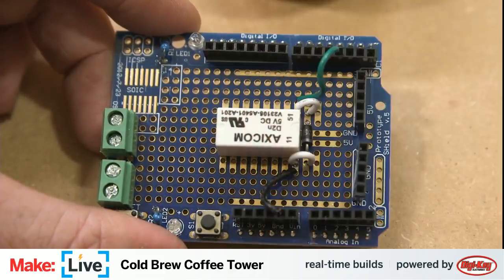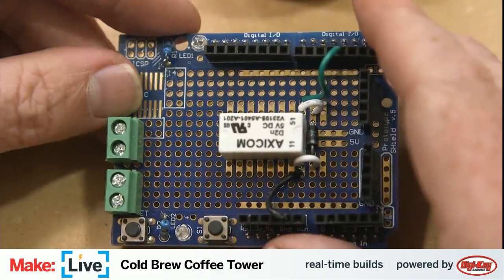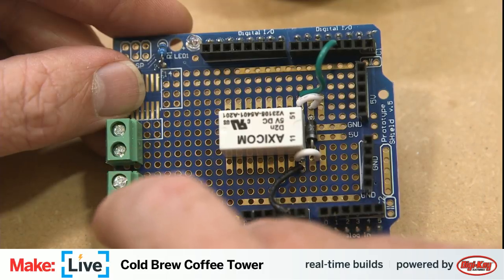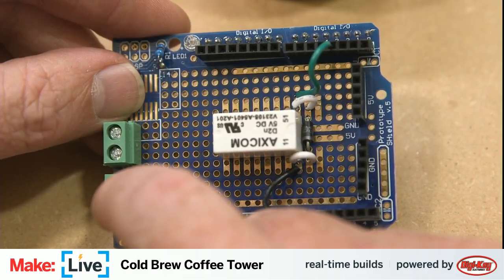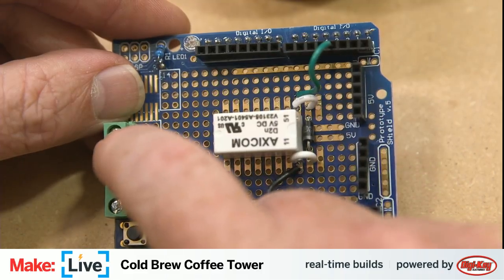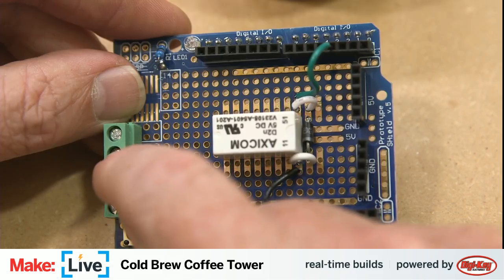And then we'll just form a quick circuit. So let's actually think through this. Let's connect the positive side of the voltage. So we're going to have one wire, let's say this is positive on this terminal block. We're going to go in on the common and have that go out on the positive side of the solenoid. And then we can connect the negative directly over. Sound good? Let's do it.